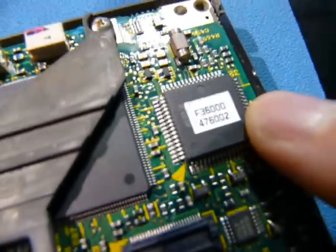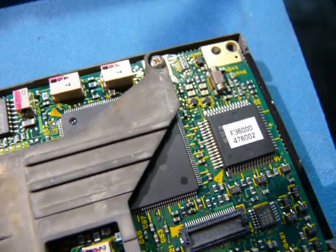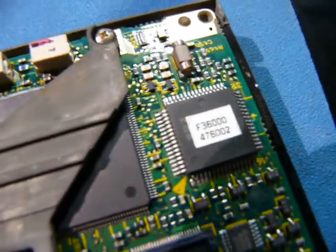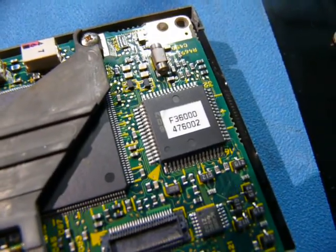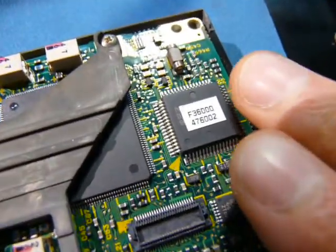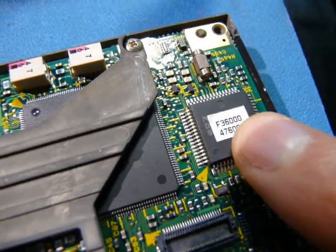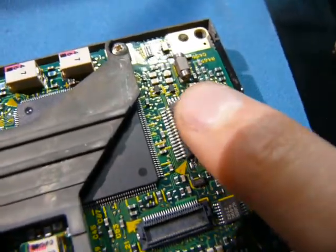This device here with the code on top of it is actually a microcontroller - it's a PD78P014. It has something like 32K of one-time programmable ROM, 1K of RAM, and various other bits and pieces. It runs at maybe around 10 MHz or something like that. I would guess this thing is running all the power management, like the suspend to RAM and suspend to disk functions.